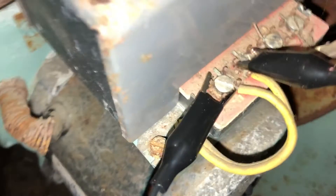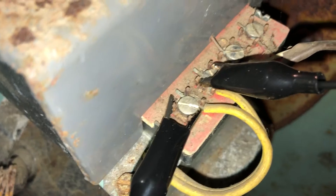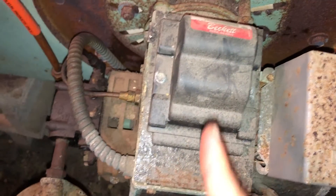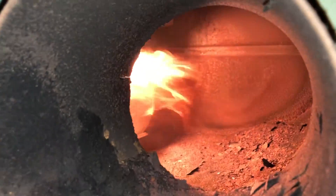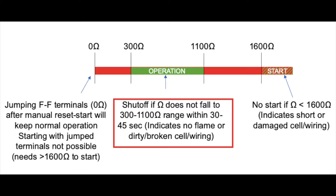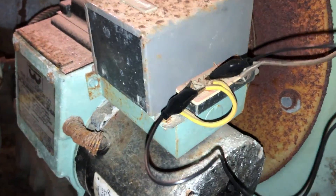Right now we've jumped the two wires on the CAD sensor, which is a cadmium flame sensor. If there's too much resistance in the flame sensor, the unit will shut off. The flame sensor is in here and it basically looks at the inside to see what you'd see through this peephole, which is fire. Without this black wire, the flame sensor would say there's not a good flame and would shut off the power within 30 seconds. So we've got good oil, good flame, and good airflow.